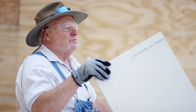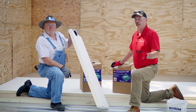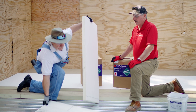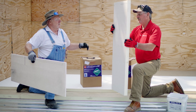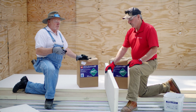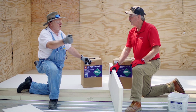That's the stuff right here. What are some of the advantages of this over, say, a standard gypsum type material? Well, number one, it's a lot lighter. A four by eight piece in gypsum is about 64 pounds. This is about six pounds. So there's one advantage — it's a lot lighter to carry across the roof. With gypsum you need two guys to carry maybe three or four sheets, but with this two guys can just slide the whole bundle across.